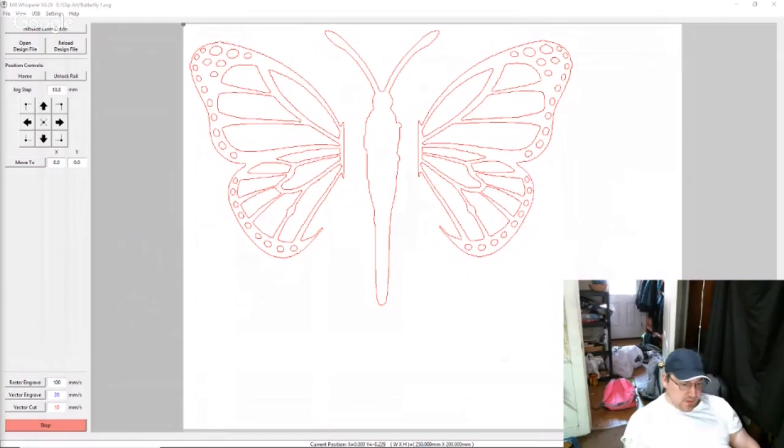Second, throw in a piece of cardboard underneath your laser end there, to give you something to burn. Three, there's a hole underneath, relatively close to the home position of that laser when you're printing with the vise or the little jig. So you may want to put a piece of cardboard underneath the frame, just so if it does burn, it's not going to be burning your table when you're testing.